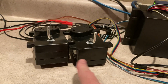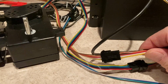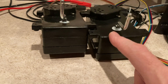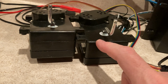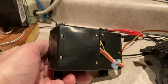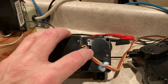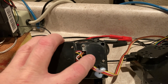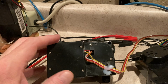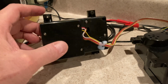these motors. Each motor has one micro switch, and the motor outputs are 5-wire. Two of the wires are for the power, positive and negative, and then there's a normally open and normally closed, and a ground, on the micro switches in here. So I'm going to pop the back here. Here's one of them, and you can tell right off the bat the orange one and the brown running in here, that's where the motor is. And then we've got a yellow, a white, and a red that run into, underneath this panel right here, where that micro switch is. I want to get in there and verify that's what that is. I'm sure that's what all the rest of them are.